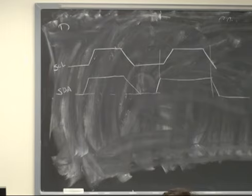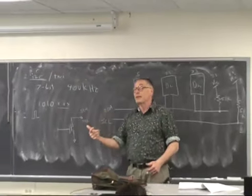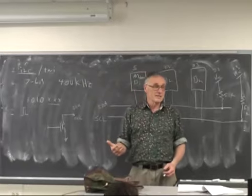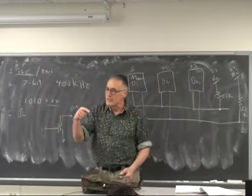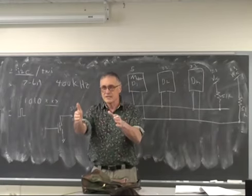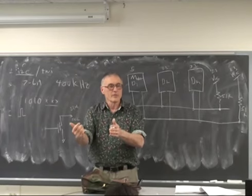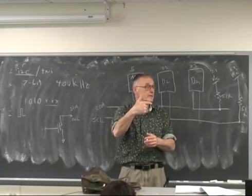By the way, even though it sends 8-bit data or a 7-bit address, every packet is 9 bits, because the 9th bit is reserved for an acknowledge bit back from the receiver. So the transmitter sends 8 bits, and in the 9th bit time, the receiver acks back to the transmitter to say, I got it.